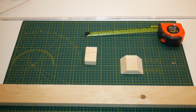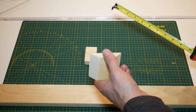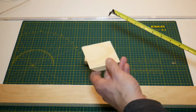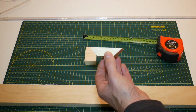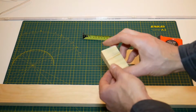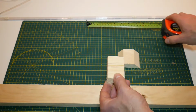And so after we have all of the items we need for this project, we can get started by making our first cut. So the first thing I did was I took my 8-foot long piece of select pine and I chopped off a 3-inch piece. So you can see here from the longest edge, it's about 3 inches. And I made 2 mitered cuts at 45 degrees. Second cut I made was just 2 square edges, and this piece is about 1.5 inches long.